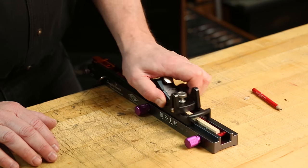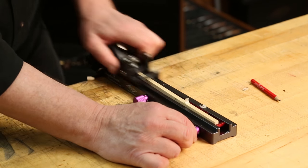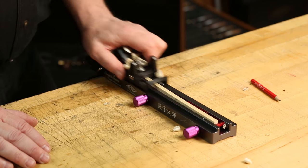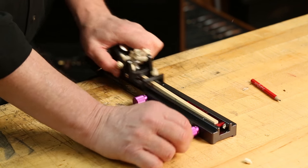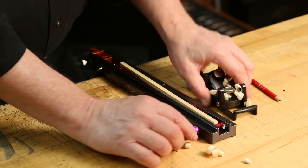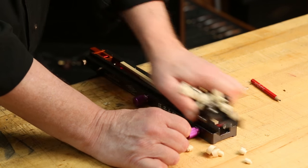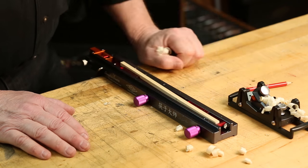And we just push. There are lots of techniques on planing — I've seen people do it fast, and I've seen people do a more soulful approach where they can actually feel each shaving come off. My response is: why not enjoy the process? You're not in a hurry. You'll notice it's cutting more down at the end than at the top, and that's because we're creating a taper. You're just going to continue to cut until the plane no longer is cutting — you'll feel it. When it's not cutting, we're done.